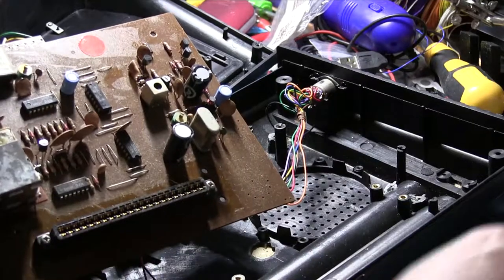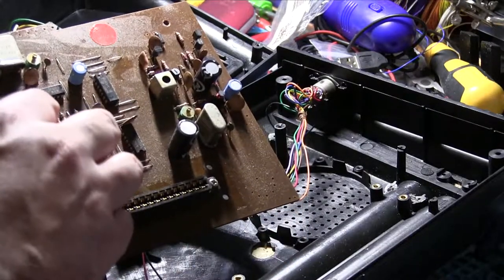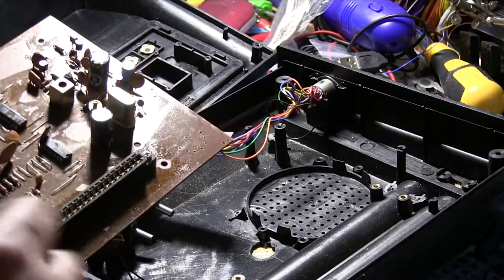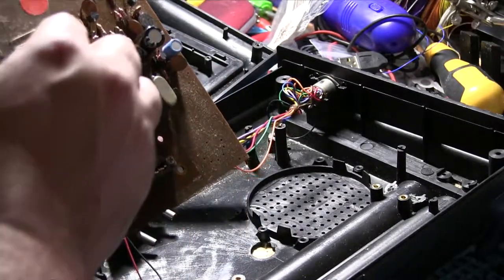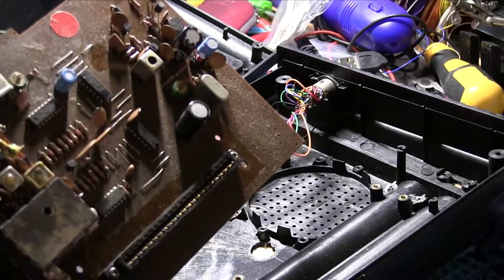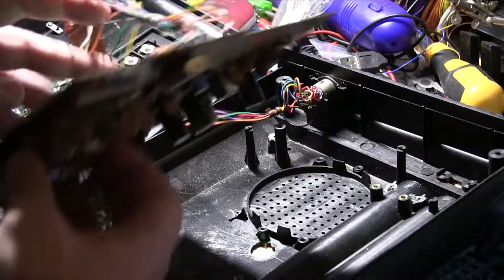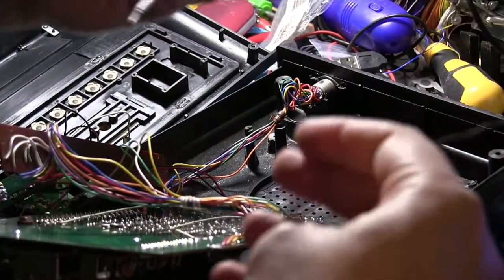Replacements are quite a bit smaller because technology has improved since this was made. They're also probably much better quality than the ones that are in there already. The polarity is all over the place as well. If I try and design a board I try to keep the polarity heading in the same direction and I also mark it on the board - they've done neither of those things. So we need to keep our wits about us for this one. We're going to be replacing this one first - a 47 microfarad - and the negative is on that side. I've got to be really careful I don't singe any wires. I do not like working in these cramped conditions.